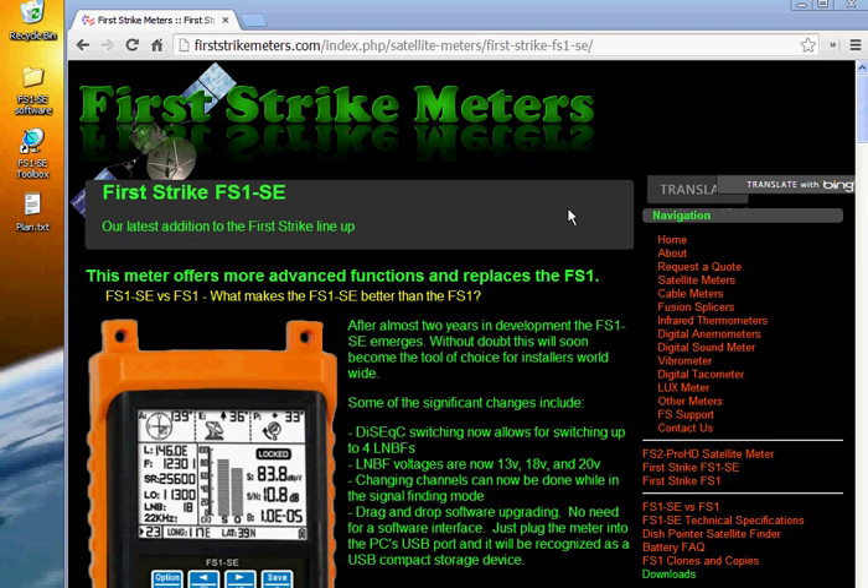It's actually upgraded now, but I always like to do a reset on the meter just to make sure that it's a clean upgrade. To do that, your meter's on and you want to turn it off. You turn it on and before the boot completes you press 990, and that will reset your meter. You'll know it's reset because resetting the meter erases the longitude and the latitude and it'll also erase your user database.